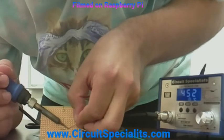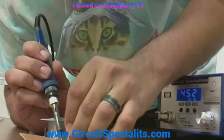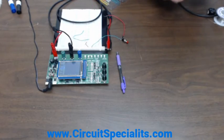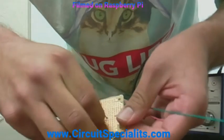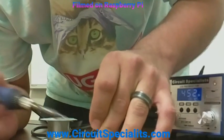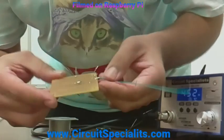I hate the fact that I always get soldering smoke in my face, so often at home I use the BK486, which is basically a fume extractor fan that pulls these toxic fumes away from your nose — for those of you who are a little more health conscious like me. We've got some leads going on here and what we're going to do is tie these together by simply bending them over, wrapping them together, and putting a glob of solder on. None of these holes or traces are connected on the perf board, which is great for prototyping. We also carry a circuit scribe pen which is conductive ink, so you can actually draw between traces rather than having long streams of solder — and this works very well.